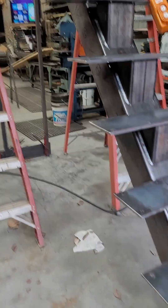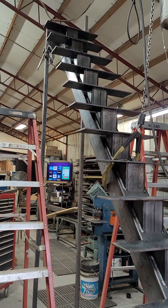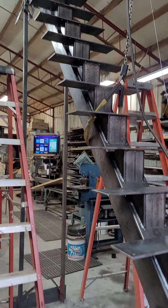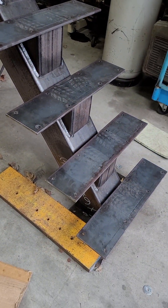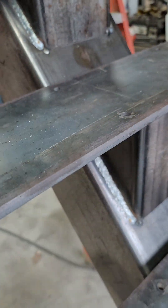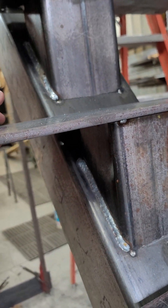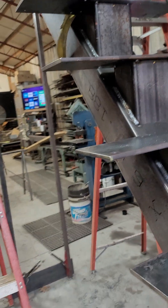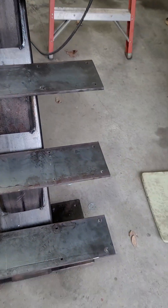If it's going to be inside the house, rust isn't really going to be an issue. I hope to have this finished up by tomorrow — I'm getting ready to lay it down, weld some more welds today, and probably finish welding the treads on tomorrow. They're all tacked on and already in place with small tacks. Once I flip it over, I'll get those welded on good. You can see some small gaps, but all that gets covered with weld. The main thing is the treads are level — that's what gives your customer a good level surface to bolt their wood.